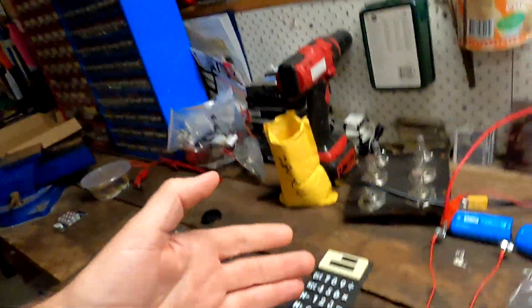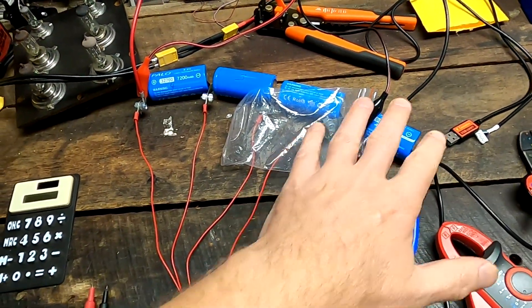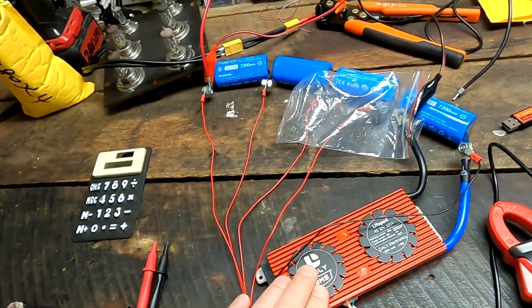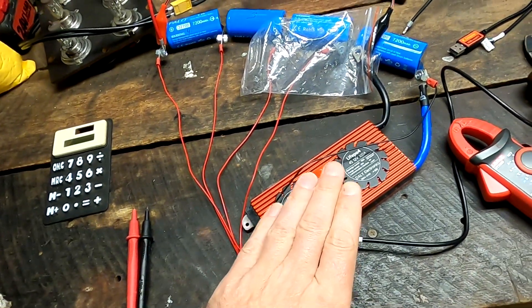This was my first experience with the DALY BMS here in the off-grid garage, and it looks like this was probably my last. Not just because of the balancing, but this is just not what I was expecting. I expected a really good app, good software, and a good BMS. But this is more like a protection board — it protects against single cell over and under voltages. I got in contact with the manufacturer and they apologized for not including the NTC temperature probe, which they've forgotten. It's on the way. I just wanted to buy one and have a look at the DALY BMS because so many people buy them — and now I don't know why.